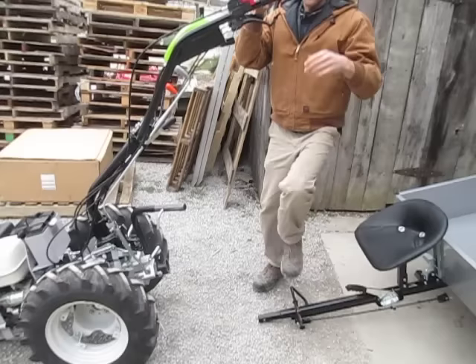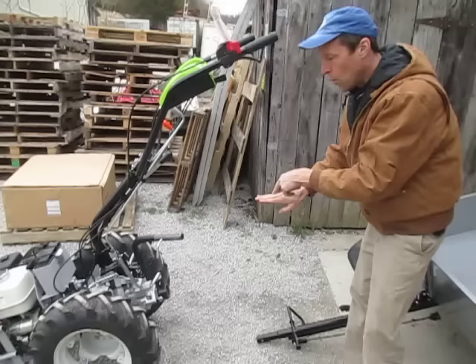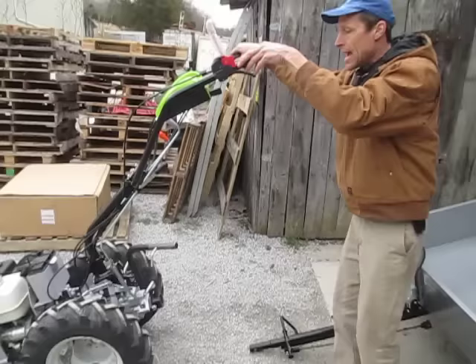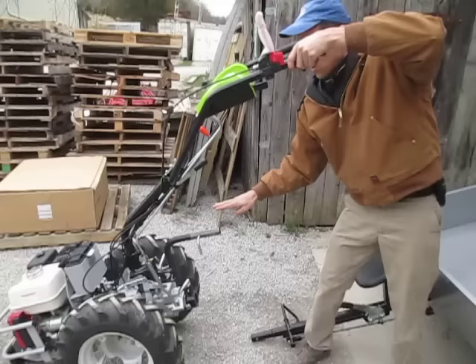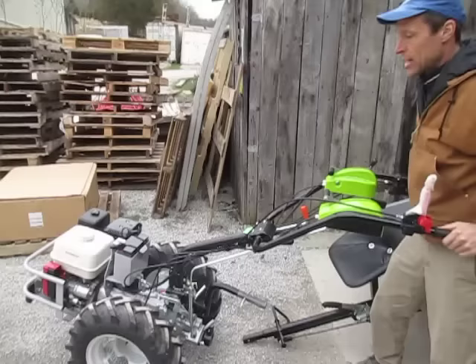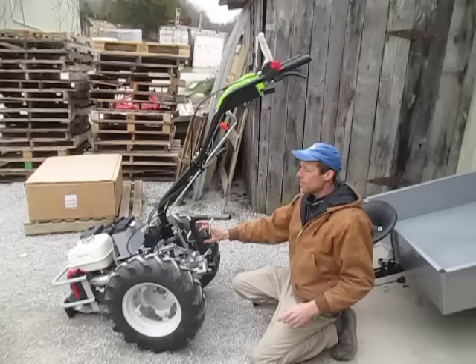If you just had a standard utility trailer like for a lawn and garden tractor, those usually just have a hitch that's a flat piece of steel with a hole through it. If you're hooking that onto the back of a garden tractor, that's fine because it's got four wheels on the ground, two axles, and it's stabilizing itself — it's just dragging the trailer. In the case of a walk-behind tractor, you're relying on the tongue of whatever you're pulling to give you the stability needed to keep this engine up off the ground. If the trailer is not holding that — like being slid up over this pipe — if this were just a little tab of steel with a hitch pin going through it, it would just flex on that hitch. Every time you let go of the handlebars, the engine would fall on the ground. Also, every time you let out the clutch to engage power to the wheels, the unit would kick back, because the driving force of the wheels would be transferred through the axle and just try to pinch you every time. So you've got to utilize this double clevis, which actually locates the tractor through the tongue of whatever it's attached to.